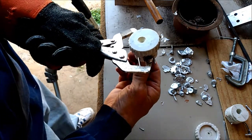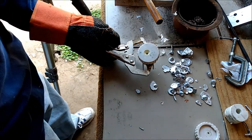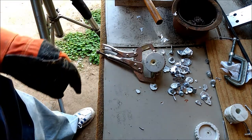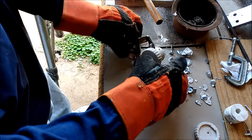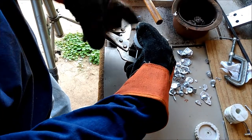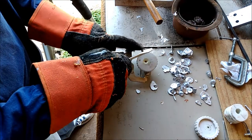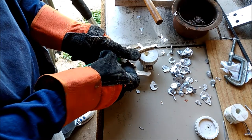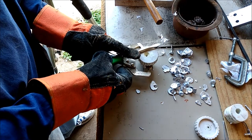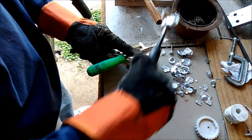I'm going to try back-to-back casts with the hollow-pointed 9mm. Let me put my glove on so I don't burn myself. I'm going to try to do it as quickly as possible, and also manually hold down the sprue plate — because if I'm getting flashing on top, it's causing the top edge of the mouth of the hollow cavity to degrade.